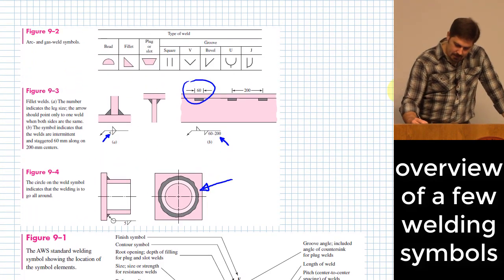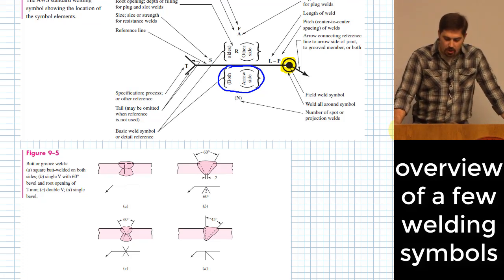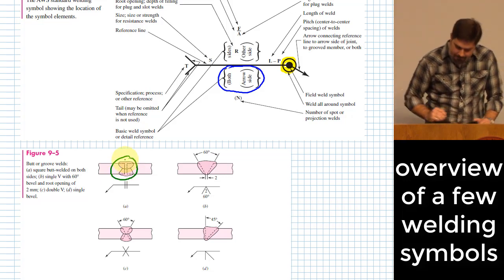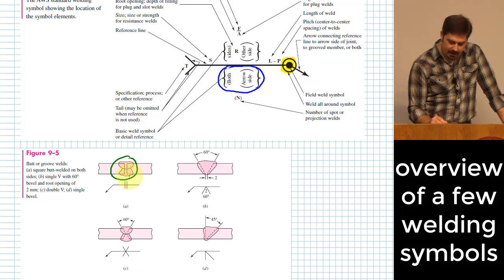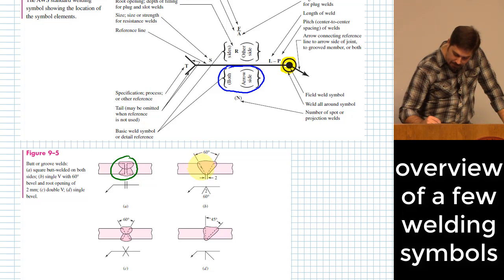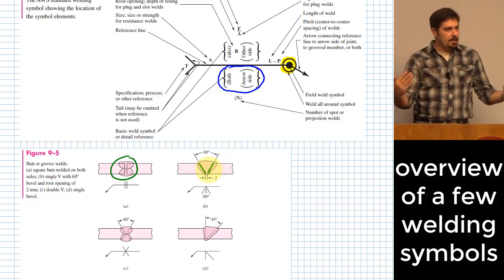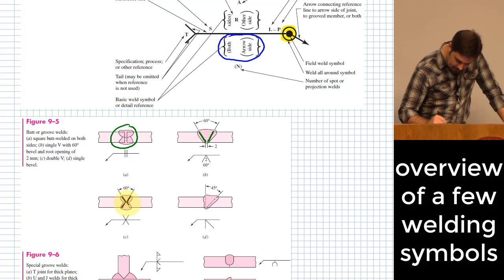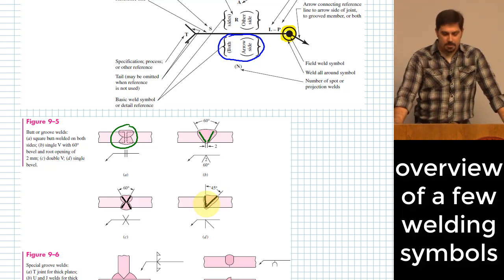Oh yeah, grooves. Okay, so sometimes whenever you are trying to put materials together, it makes for a stronger weld if instead of, like, for example, this was a butt weld, very much like the one that I showed you here a second ago, right? Well, typically it is possible to make a stronger connection here if instead of just butting things together and allowing penetration of the weld to go far enough to allow full joining of these two things, it isn't uncommon for there to be both sides of the weld prepared with some sort of a way to allow the weld to go deeper into the two things that are being joined. And there's a number of ways to do that that are outlined right here. You can have this happening on two sides like that. You can have just one side that's beveled to allow deeper penetration of the welding process into the two pieces that are joined together.